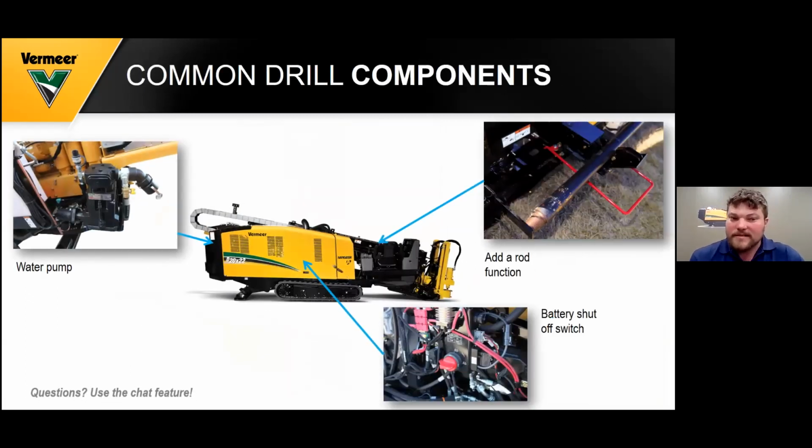So your water pump, you can test that by hooking up a pressure washer wand and seeing if your valves move correctly. If they're moving fast or sporadically, more than likely you've got a rock or something in there and could need a valve replaced. And we're in this time of year where it'll be warm during the day, but could get below 40 degrees or freezing. So you need to remember to antifreeze that water pump, because antifreeze is a lot cheaper than replacing a water pump.